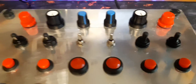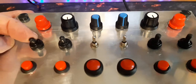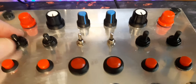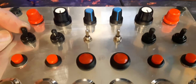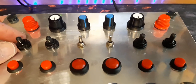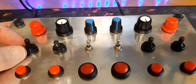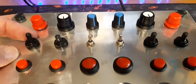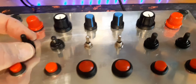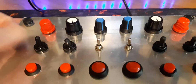The next set are six buttons, configured in different ways. The first two are toggle buttons — two-way toggles, not three-way, meaning they don't rest in the center; they're either up or down. Most toggle switches are a single on/off, but these are dual switches: pressing up activates one button, pressing down activates another. This is useful for things like gear control — gear up or gear down — or an arresting hook or catapult hook, where there are two callbacks in the software that you can map to the up and down positions.